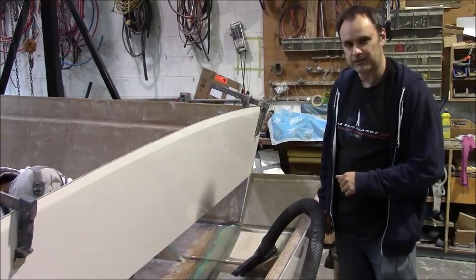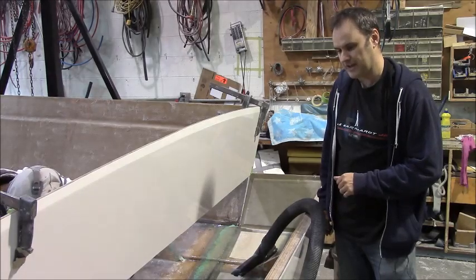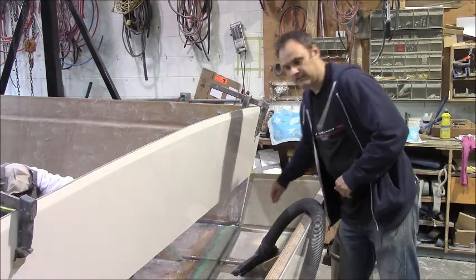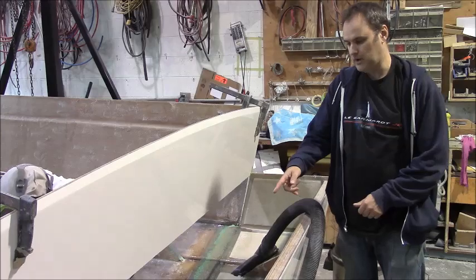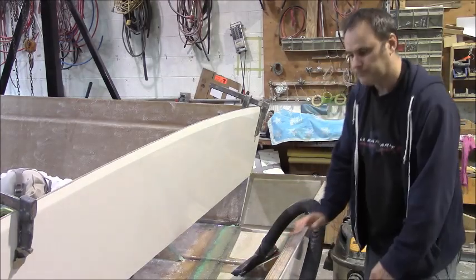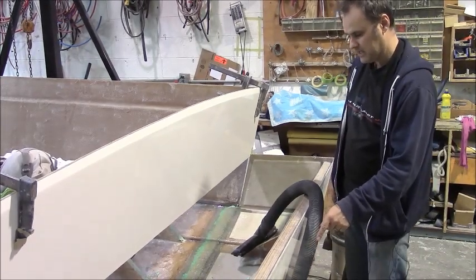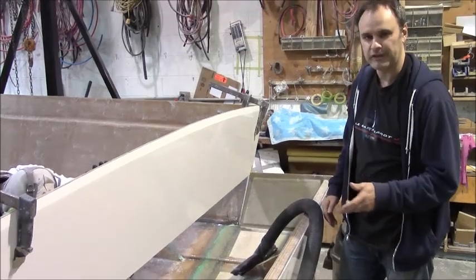We'll be away next week, so I just wanted to get this last video in. Hopefully they'll have it all done. The next step after they've done the glassing here is they'll be glassing the sides, then finishing underneath. There are a few holes through the bottom from screwing the straight edge on just to keep the hulls lined up and faired nicely. They'll take that off and fill the holes so the boat doesn't sink.